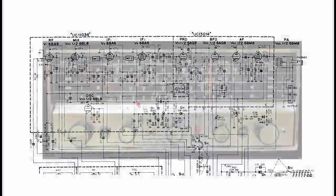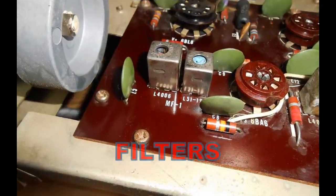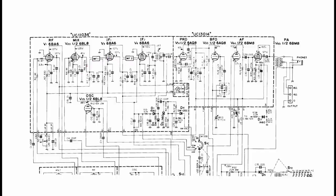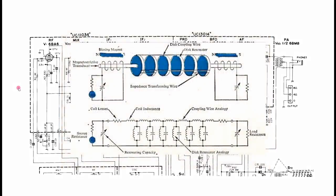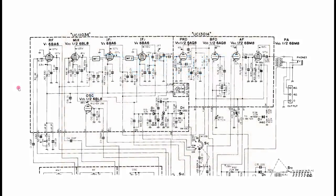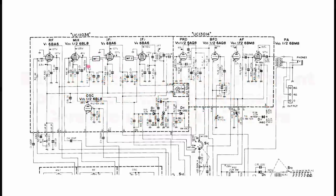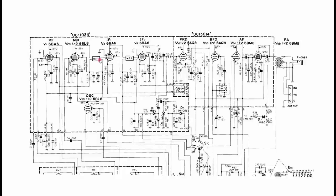Receivers like the old S120 would have real trouble on band 4 where it does not have great image rejection. These MFs really stand for mechanical filter. When I hear the word mechanical filter, I immediately think of Collins — mechanical is a misleading term, it invokes the patented Collins system, which are very expensive filters. I will assure you these are not Collins mechanical filters. These filters are narrow ceramic resonators with tuned transformer shaping and terminations on each end. They're nice little assemblies — very effective and sharp. They're maybe a bit too sharp for people that like good quality AM.